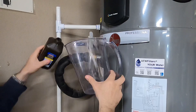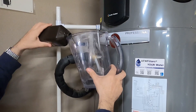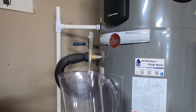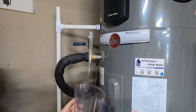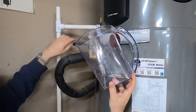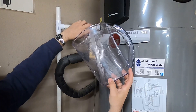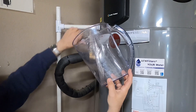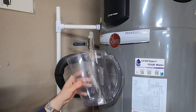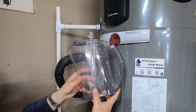So I'm just going to go ahead and pour some of this hydrogen peroxide into this container — that's about it, really all it needs, about a quarter to a third of the bottle. Then I'm just going to take it and put it up to my intake line here and rotate my valve. You're going to see that it all goes into the top here. I lose a little bit of water coming out the bottom through the drain, but that's okay.